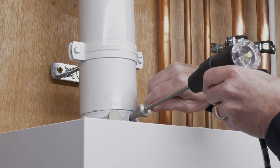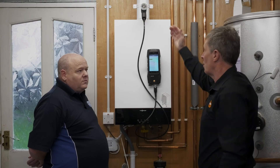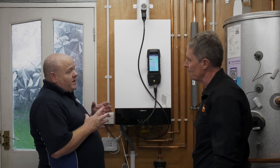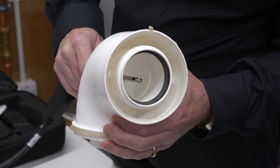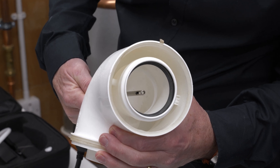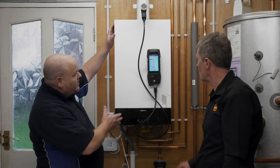Just loosen the cone off on top of the boiler test point, put the probe in, and we're looking for about half the depth into the flue, then lock off on the cone. We're now ready — when the boiler is fired up we'll be sampling the gases through here into the instrument. It's important to position the probe correctly; a lot of trainees tilt it downwards and it can actually suck in water from the inner flue. You always have that danger if you put the probe in too far — it'll pick up pools of condensate and suck them straight into the instrument.